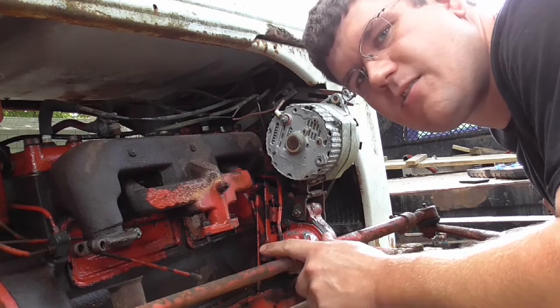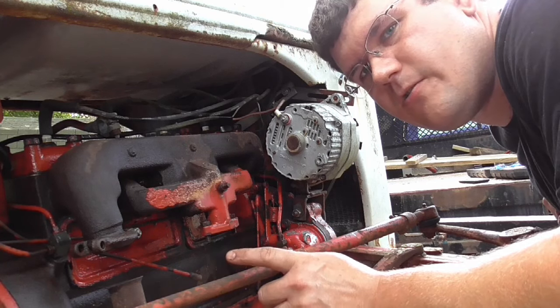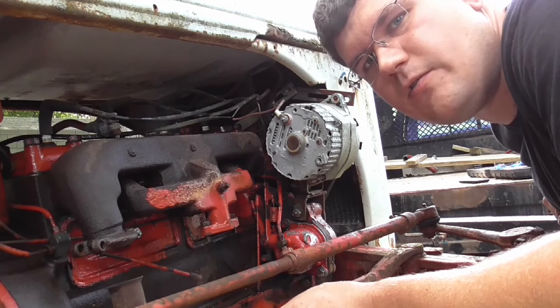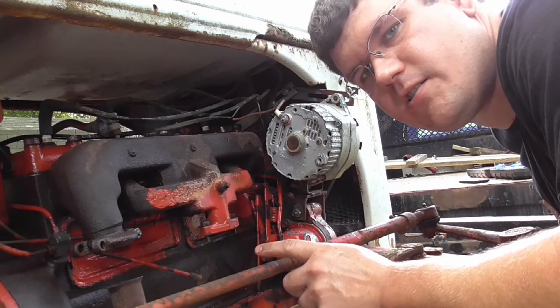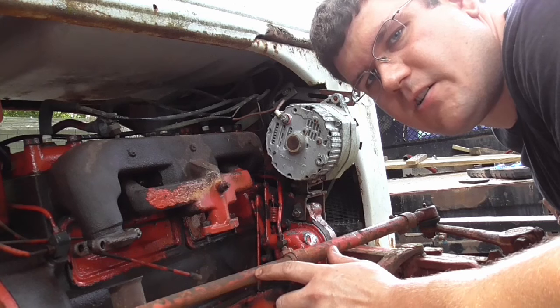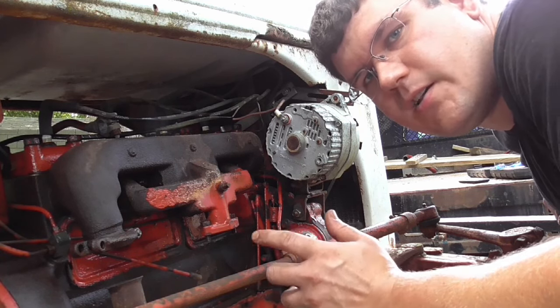So let's get this carburetor bolted on there. I'll leave the exhaust off for right now, to make sure the thing fires first. I think that muffler's full of mouse nests and stuff like that. I'm gonna do a half clean on the carburetor, put it on there, and try to put this thing together. If I spend much money on it first, I'm gonna put more money into it than I have to if it doesn't run. So let's go from there.